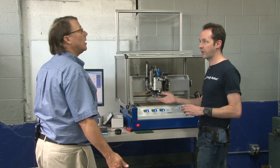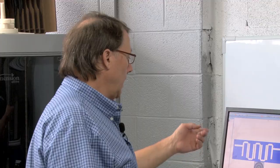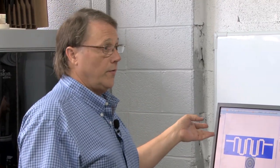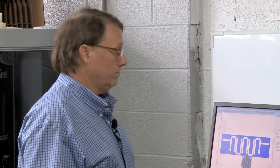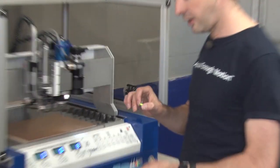Because there's a lot of stuff where you're dealing with RF microwave applications where that trace really needs to be that wide. And this in particular is a 3.3 gigahertz microwave filter — that's just the test design we're using today. So I have a bit here that is .0625. How do we load this into the machine?